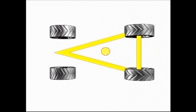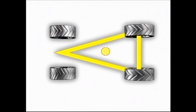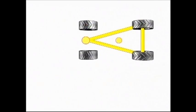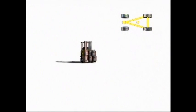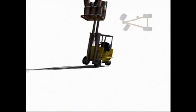The stability of each forklift is determined by ever-changing factors based on the stability triangle. The front axle acts as the base of the triangle and supports the weight of the load. The sides of the stability triangle meet at the point where the forklift steers, either at a single wheel or in the middle of the steering axle on four-wheeled models. The center of gravity for the forklift is changed by the load and by momentum, and the forklift will tip over if either of these factors forces the center of gravity outside the stability triangle.